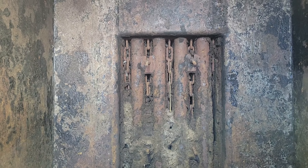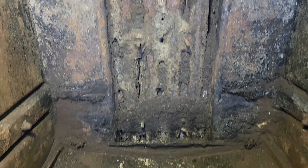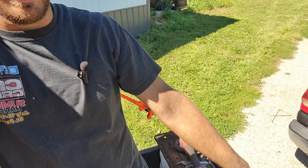I got the firebox cleaned out and scraped out for the most part. I got the back cover out of the firebox, and this is where the heat exchanger is at. It is majorly built up with creosote — all that is creosote that burns up behind there, and those chains are supposed to be free. I've got to try to get all of that cleaned out so the machine can be efficient again. That had to be one of the dirtiest jobs I have ever done. That was pretty terrible, but I did get everything cleaned out.